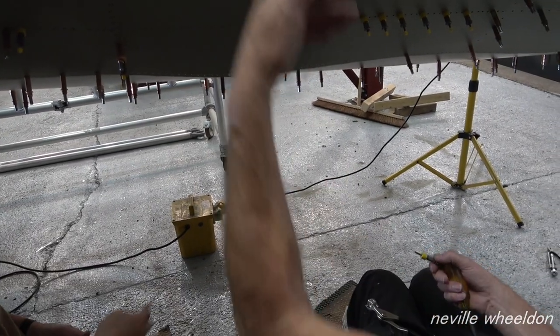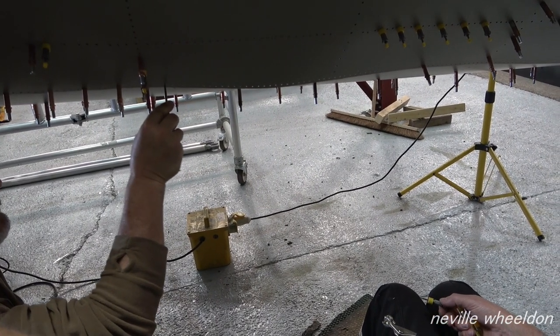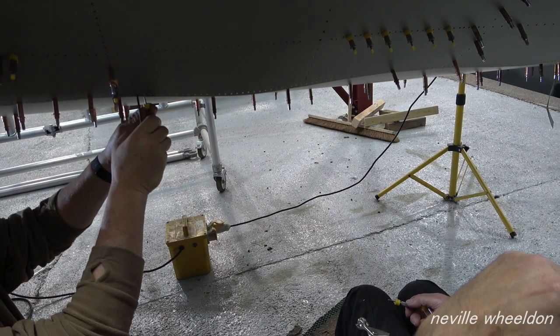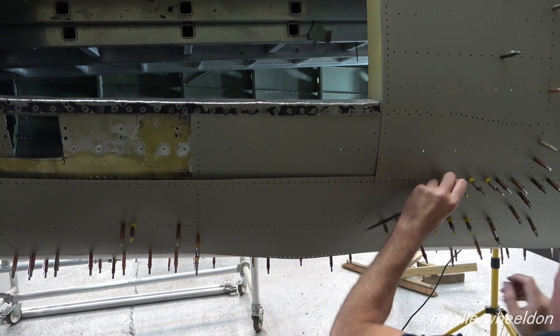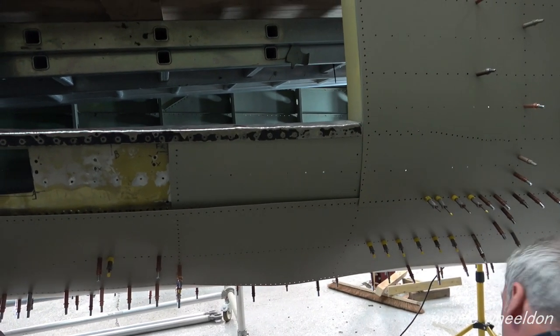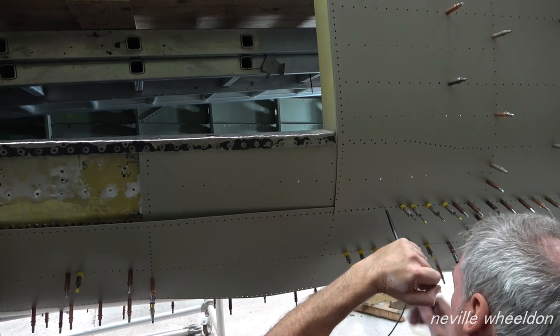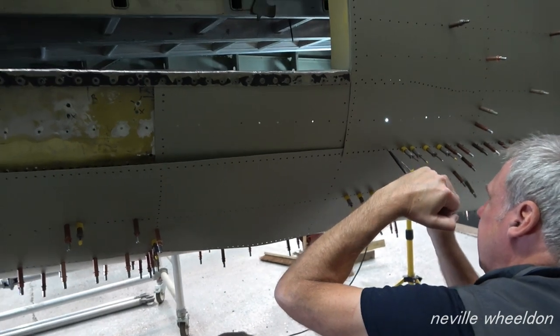it's because it's a double curvature. You see the radius at that end. Oh yeah. It's slightly different to the radius at this end. Yeah. It's got a double curvature going on. Surprising how strong a structure it'll be when you get it all riveted up. It's amazing. Well, even with these gripper pins. Yeah. Well, I can see now, you know. The rigidity goes into it. Yeah.